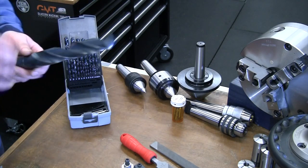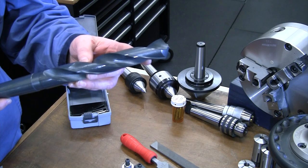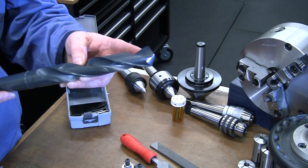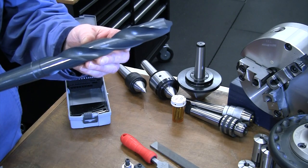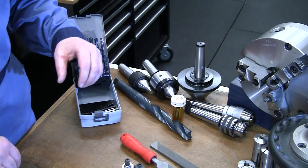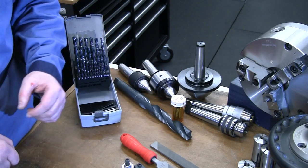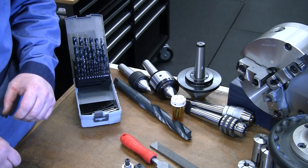For larger projects requiring a big bore, I have a one-and-a-quarter-inch drill bit to quickly get to that size and then use my largest boring bar from there. The smaller the boring bar, the lighter the cut you need to take, so if you're making a two- or three-inch hole you want to drill as large as you can first. There are other tailstock tools I don't currently have — specialized tap holders, die holders, floating reamer holders — but right now I do most everything with drill chucks.